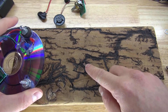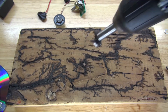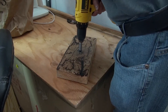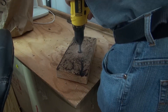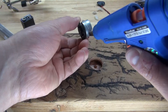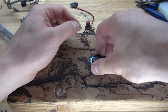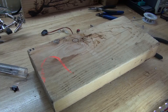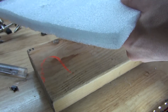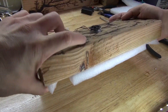I have a piece of wood here which I've turned into Lichtenberg fractal art. The center dot is the center of the wood. I'm going to take a drill bit and drill a sinkhole deep enough to place the DC motor inside. Drill the hole, then put a small amount of hot glue on the DC motor to glue it into place. Next, take some foam and put it on the back of the piece of wood to stabilize it, reduce vibration noise, and keep it steady while the motor spins the CD.